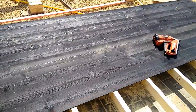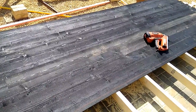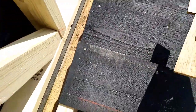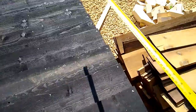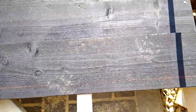Now normally on a timber structure like this where there's no windows or anything, it doesn't really matter if you creep a few mil. But if I was gauging this so that I had a full course across the top of a window rather than a cut, it would matter because it's much more important that it's in the right place. So what I've done to correct this is gauge out, put a mark with your gauging stick, then record that measurement from the second course which you know is right, take the same measurement from the second course on the other end, and then snap a line all the way along. Then you know you're back on track and that course will be straight.